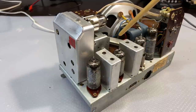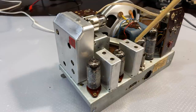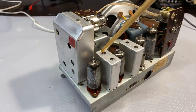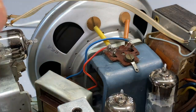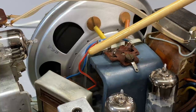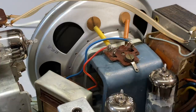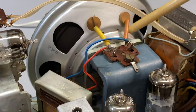And it's actually quite clear, if you look at the service manual, that the inner ones, in other words, those two, and the corresponding two underneath, are for the AM-IF alignments. And then those two, and the corresponding two underneath, are for the FM. So, in the first stage of this alignment, we'll be dealing just with 1, 2, and the underside 1, 3, the underside 1, 4. I've actually removed the speaker connection here because I want to be able to measure this without hearing the noise. If you know how to do the alignments, and I'll describe it as I go along, it does get irritating hearing the tone all the time.